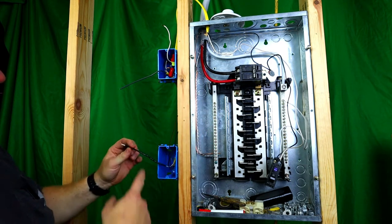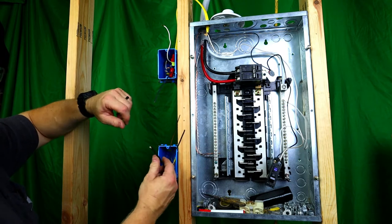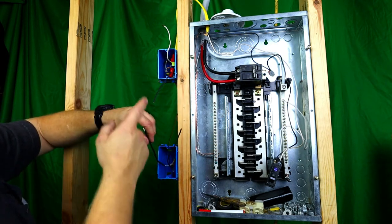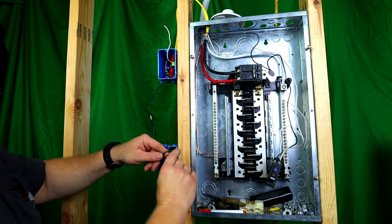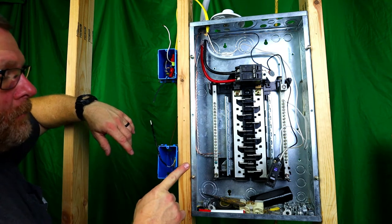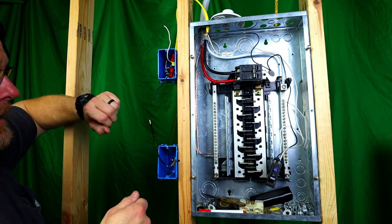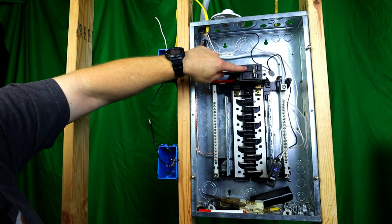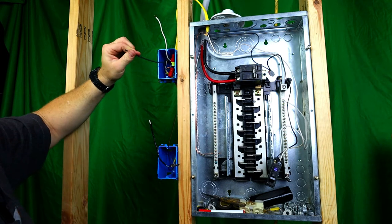What we're left with is this black — the tape one. So if you remember, we took the main hot coming from this panel and we put it on that white wire, the one we taped. Same down here — that wire is now going to be your hot wire and this will be your switch. I identify your switch and I just put a little curly Q in it, so I know that's the switch part. On a single-pole switch, it does not matter if that's on the bottom or on the top — you're only breaking your power coming in. What you're left with up here is this white neutral that comes from the panel. This is your hot going down here, which will in turn turn it on back up to this wire right here.